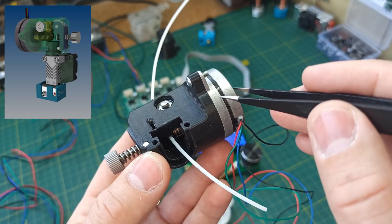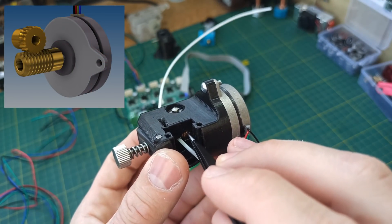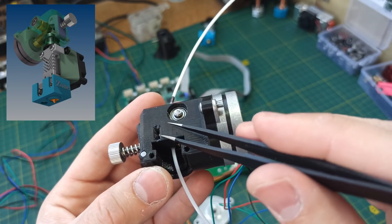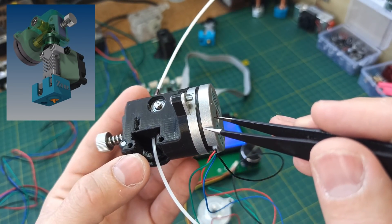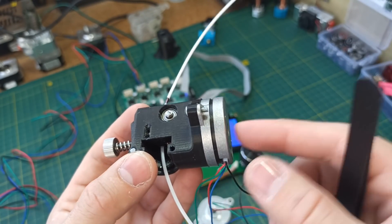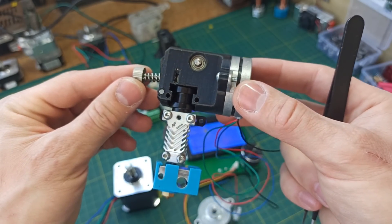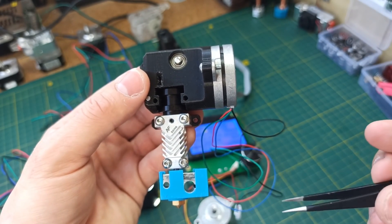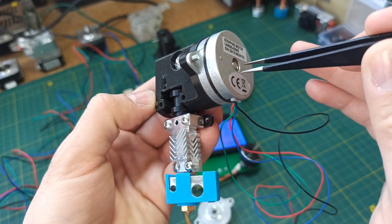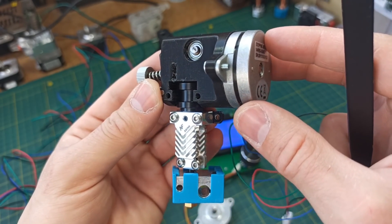The answer is that we can make a working extruder, but with certain changes. We need to change the ratio between the reductor and the motor wheel — not 1-to-20, but at least 1-to-5. In this case, the number of steps per 1mm will not exceed 400, which we already tested successfully. The reductor will then work in a stable mode and the direct extruder will work well. Unfortunately, on AliExpress I have not found a 1-to-5 reductor with the required dimensions, but I will try to find someone who can make one.